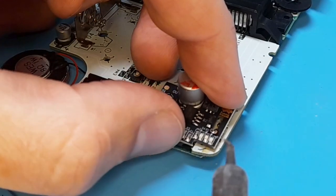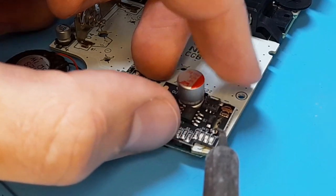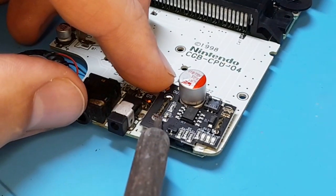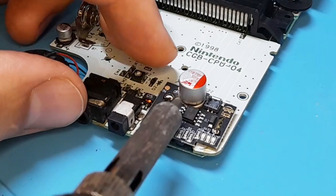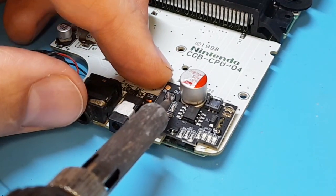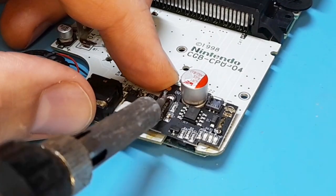Place the battery board on top of those pins that we had already pre-tinned. Our goal here is to try to merge the solder point on the battery board to the solder point on the main board. Using your soldering iron, add a little bit of heat to those pads and hopefully flow through to the bottom pins — essentially merging the solder point between the battery board and the original power board.